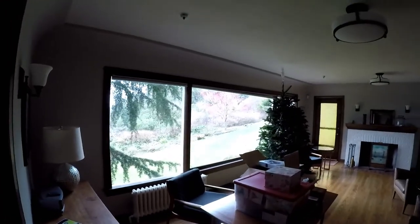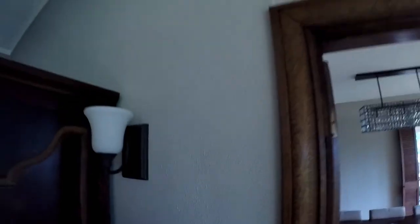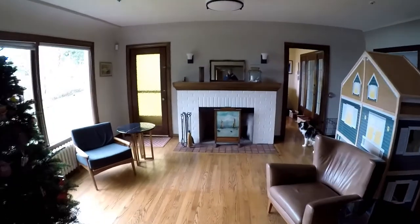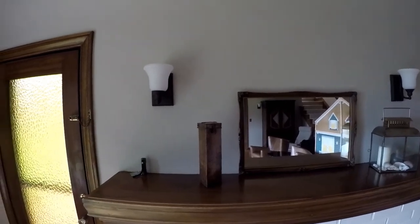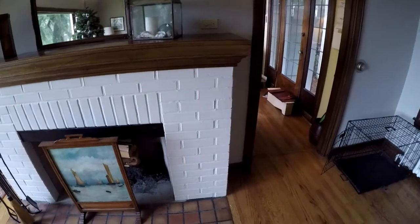This is the living room - look at those nice big windows. These are the sconce lights - remember those were hidden, buried in the lath and plaster, and we discovered the wires in there. Those are the ceiling lights, much like the bedroom lights. The fireplace has matching sconce lights over here. We had to chisel into the brick and mortar on that one and run a conduit to it, and we had to relocate that one so the lights are centered over the column of the fireplace.